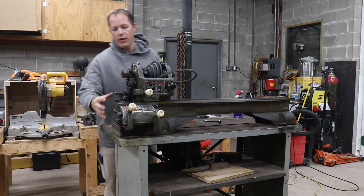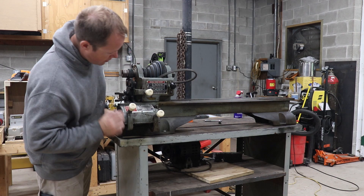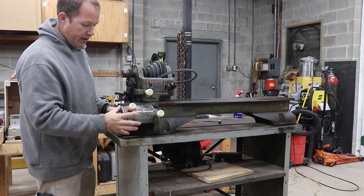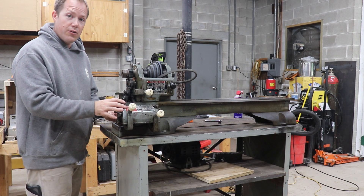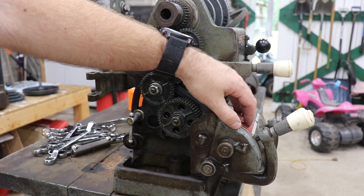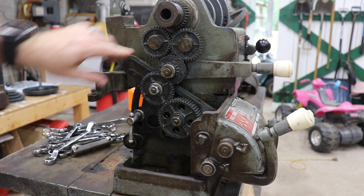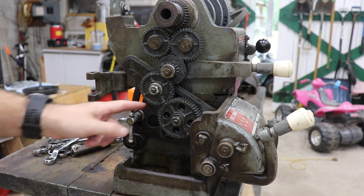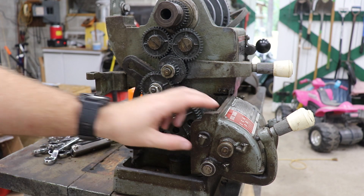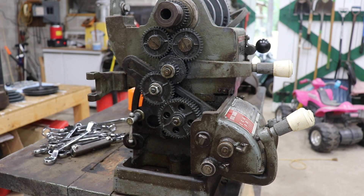While I'm waiting for paint to dry, let's go ahead and start removing the quick change gearbox. I looked at the manual and it appears we just have to disconnect a couple of cap head screws and then a bracket on the side. It looks like there's just one cap head screw attaching this to the main frame of the lathe. This mechanism here is called the quadrant according to the parts diagram, and that attaches to a bracket which has a single bolt to the frame. This bracket is joined to the quick change gearbox, so I'm going to try removing that bolt first and then the cap head screw.